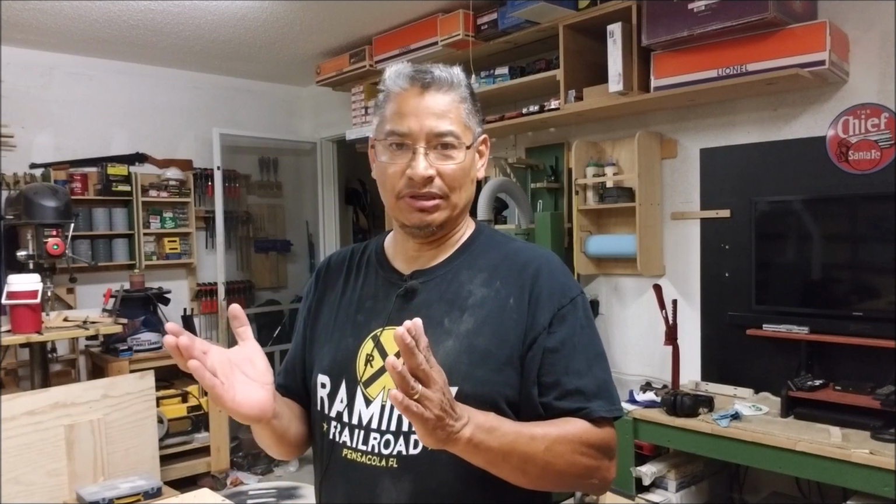And again, don't buy the big drill bit sets. They sound like great deals. You're going to get these drill bit sets that have 100 drill bits on them, and they're going to come out at barely $1 a piece. And let me tell you, not only are they not exactly dimensionally correct, but I've seen these sets where some of the bits are even bent already before you get to use them the first time. Spend your money, get a small set. Get yourself a 12-bit drill bit set. It's going to be anywhere from a 1/16 up to a 3/8 inch drill bit. Money well spent.